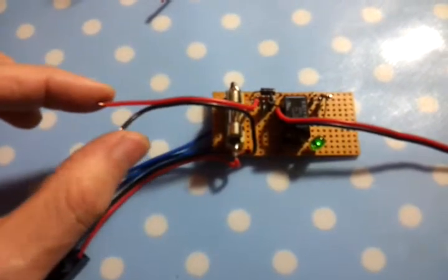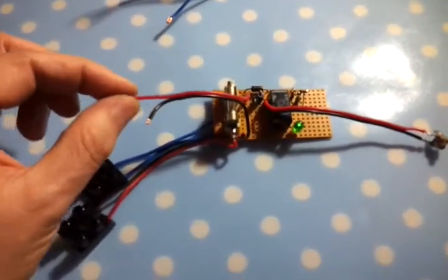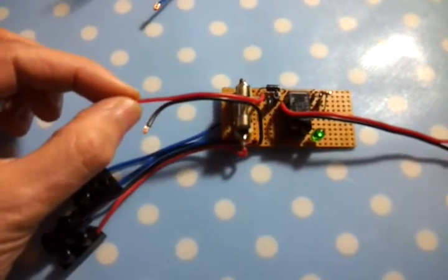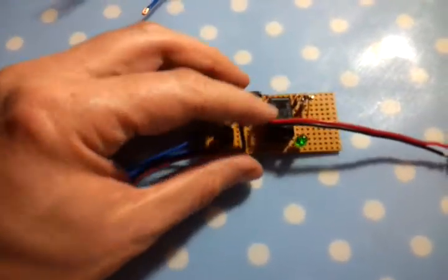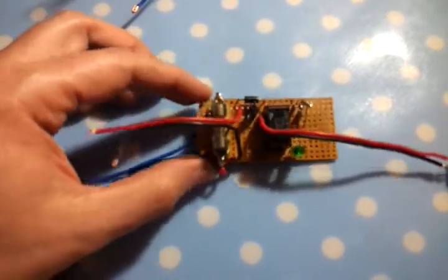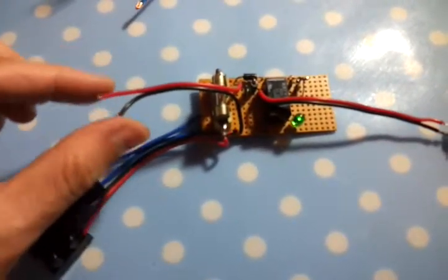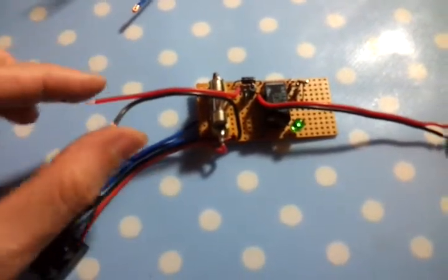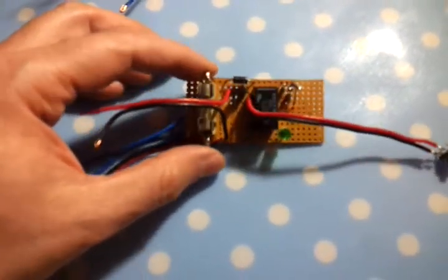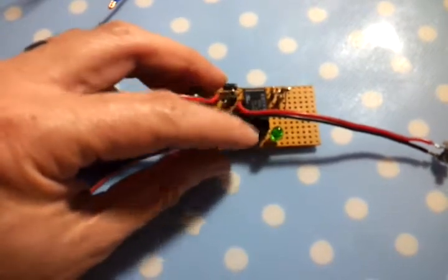This is the alarm connector that goes to the cell log. We now have to set the alarm state so that it's normally open, and then when an alarm happens the transistor goes short circuit, closes this contact, and that causes the other coil to engage and flips the relay into its other stable state. The good thing about this is that after that it doesn't matter if the signal goes on and off, because it only needs to trigger once for the relay to latch and then it will stay latched in its off position for the inverter input.